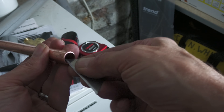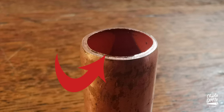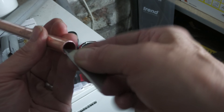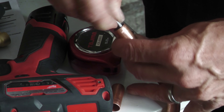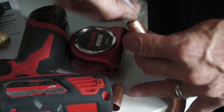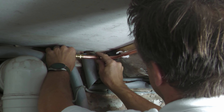As a matter of practice these days, I always deburr pipes before connecting them, as the pipe cutter naturally leaves a lip on the inside of the pipe which can cause turbulence and potentially pinholing. I use a Stanley knife blade here, finishing off with a bit of 240-grit sandpaper, but there are also specialist tools you can buy.